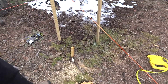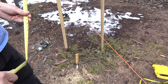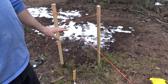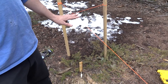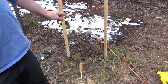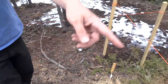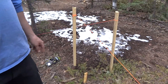So what we're going to do is the 3-4-5 rule. These two strings represent the corner of the deck platform where one of the concrete footings is going to go. We want this corner to be 90 degrees. If you measure out three feet on one part of the string and four feet on the other, then the diagonal line across should be five feet, and that means this corner is 90 degrees.